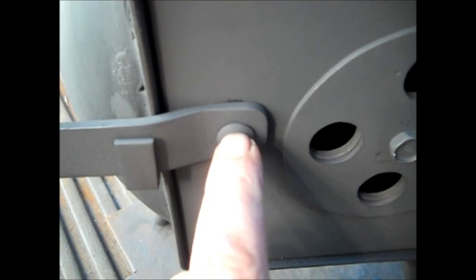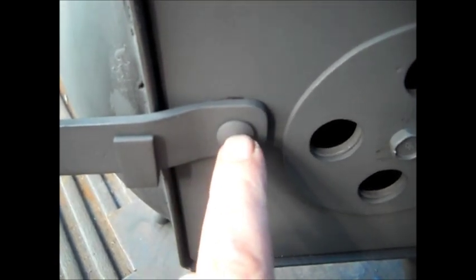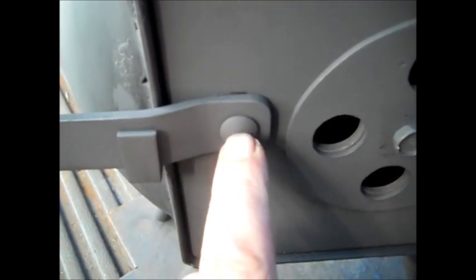That's a carriage bolt. And when we drilled the hole for the carriage bolt, we drilled the hole for the thread size. Then measure that square part and drill about halfway through your metal, and you can pull it in with a wrench or tap it in, and that will grab. The shoulder will grab like it will in wood.